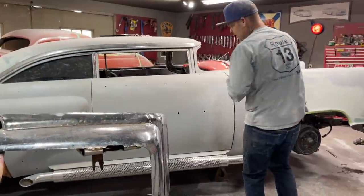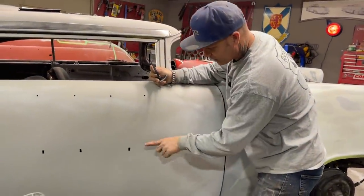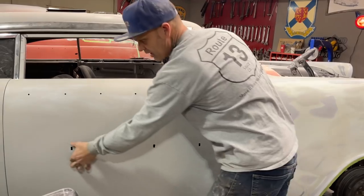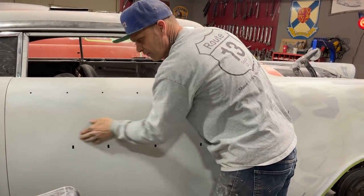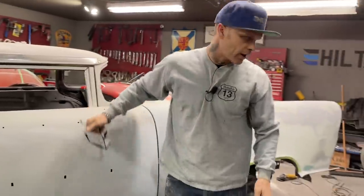Basically what I'm saying is, if I was going to do the stainless on the side of this car, if I put a piece of round rod on this side, a piece of round rod on this side, made it come to a point where the stainless comes, then I filled this out, the stainless on this car would look like it's Frenched, and it's a very cool trick.